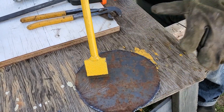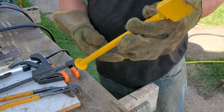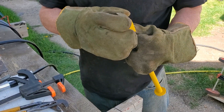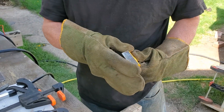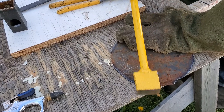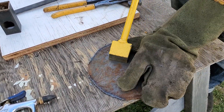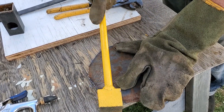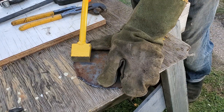If you haven't made yourself one of these, make yourself one — it's just a washer onto a five-eighths inch pipe. This is a piece of spring steel; I find it holds up pretty good. You've got to sharpen it once in a while, but for spatter and slag, especially if you've got a piece that's hard or heavy and you can get both hands on it, you can really go to town. It's pretty tough. This is actually a chunk of an old leaf spring.